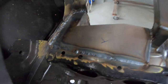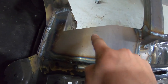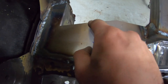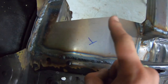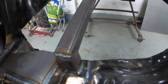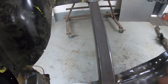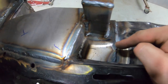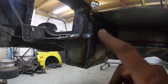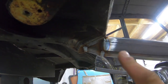Here's the final product. This is 3mm plate and there's basically going to be a bolt hole for the cross member. To strengthen this up I'm going to route a piece of roll cage tubing on it, up and triangles down, so that plate can't flex. I've got 40mm box section chassis rails with 3mm thick wall, and I've done a 3mm plate on the floor, tied that all in, capped off the chassis rail both sides, and then it rejoins the chassis rail capped off at the back.